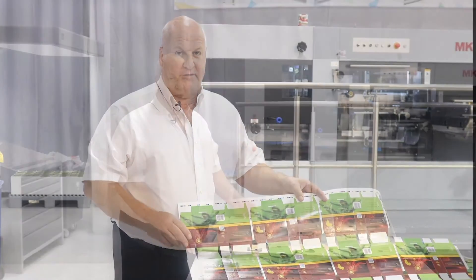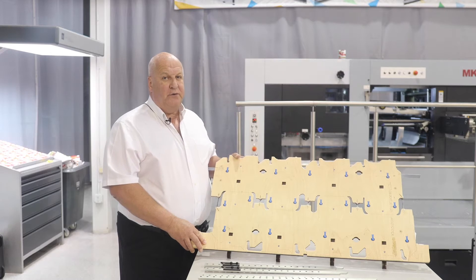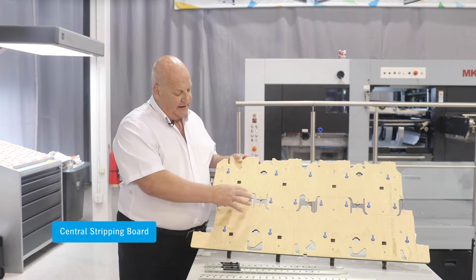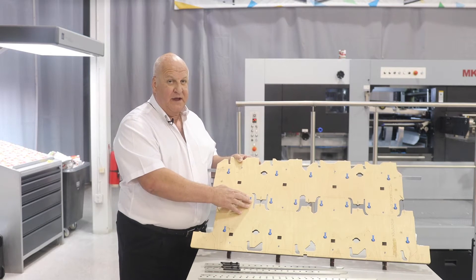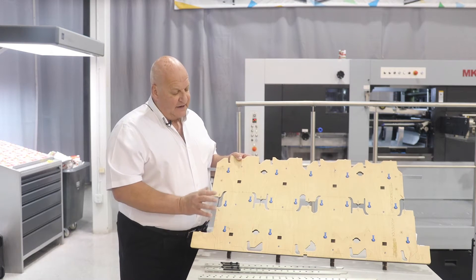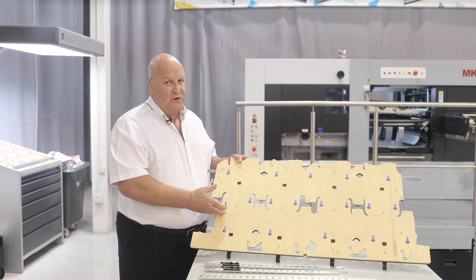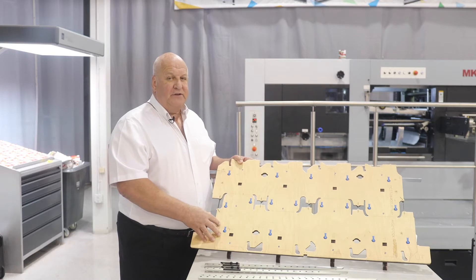Whatever tools you're going to use, you will always need a central stripping board that is cut like this, with openings matching all the pieces of waste that you want to remove. The central stripping board here is cut by laser, and this is clearly the most accurate way to do it. Of course, a central board can also be cut using a router or even a handsaw, which would also be fine.